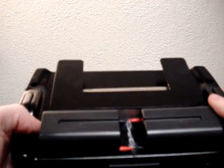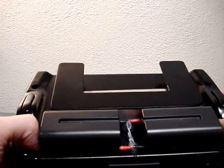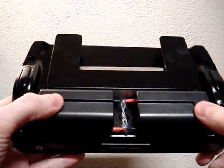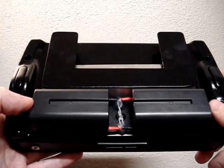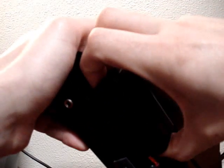There are two lithium-ion batteries — basically Chinese knockoffs of the Sony InfoLithium batteries, about $14 each on eBay. They're 7.2 volts each, wired in parallel, 2400 milliamp-hours each, so the total combined capacity is 4800 milliamp-hours. Good deal.